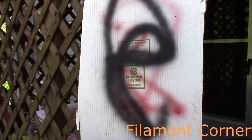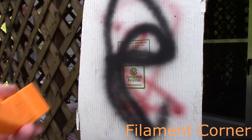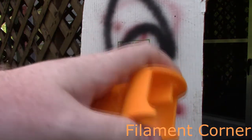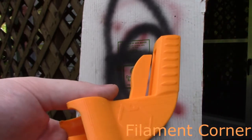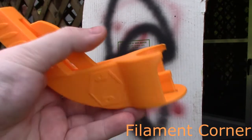But as you can see it does work. Now it may not work with your machine — what I mean by that is this is a press fit, so your machine may have better tolerances than my machine, or it may have worse tolerances. That's the downside, that's the con to this. The pro is that it doesn't need hardware and you can print without support material in one piece, but the con is that it may not work on your machine.